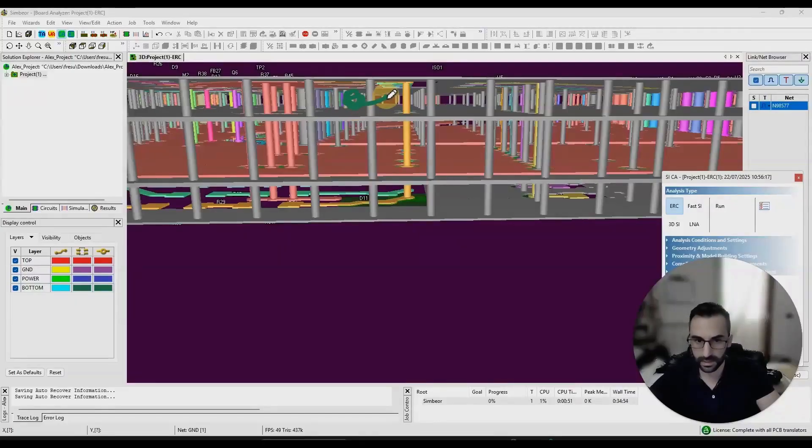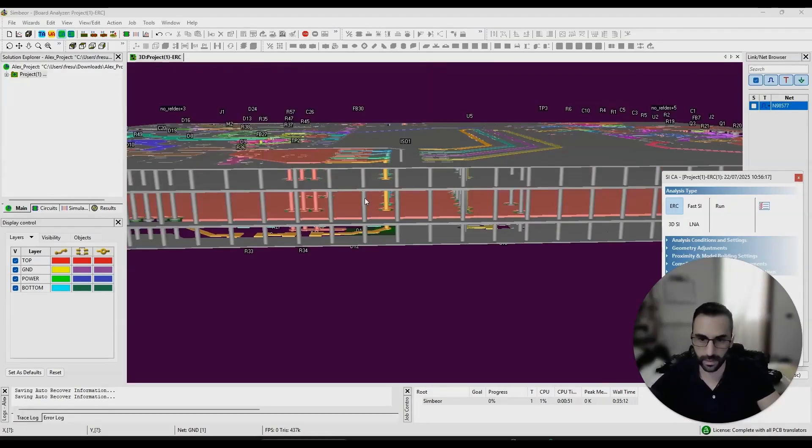The first layer and the second layer are good because the signals are going to propagate there in the dielectric. So all that space is dedicated for the signal — remember that signals propagate in the dielectric and not really in the copper plane. Also good that you have ground and power together, so the energy is essentially between those two layers. What I don't really like is that you have the ground plane so far from the power plane.